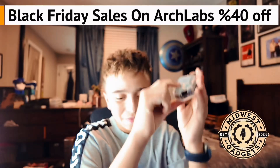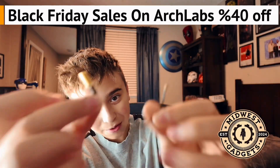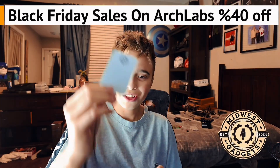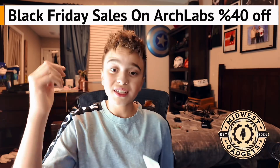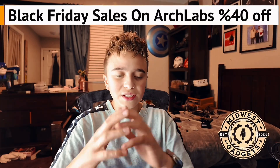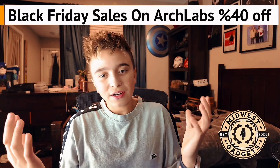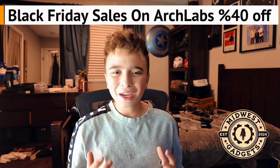What is that for? Well, I can tell you — it's for an antenna. And no, it's not for one of these antennas, though it has the same connector. You can't just get an antenna like any of these devices and just pop it on the Flipper Zero — not how it works. So what this does is it's an RFID antenna. This just pops on the back of the Flipper Zero, also made by Midwest Gadgets. They sent this to me with the extender. How this works is you have the Flipper Zero field — the antenna on it is very weak. So it's going to broadcast out as much as it can, but it's so weak because it's broadcasting out in this huge area that you're not going to get your read. Even though it's broadcasting larger, it's not strong enough to read at that larger range. So what these guys went and did is they went ahead and made that field smaller and stronger — somehow making it smaller makes it longer.